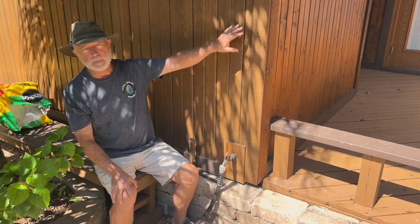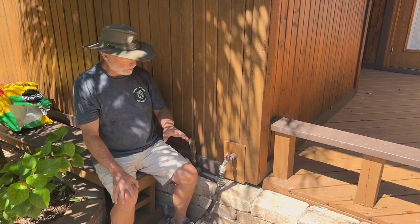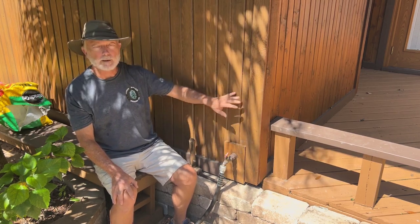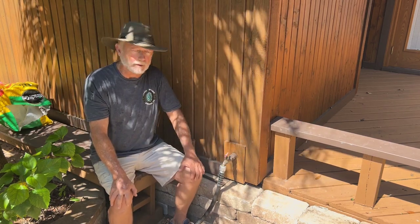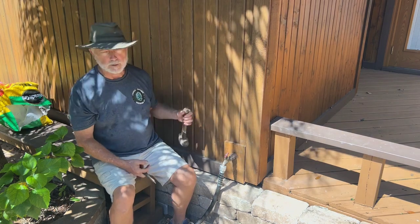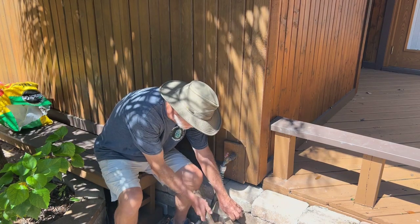I did a little detective work. We first thought maybe there was damage on the back side with water running through there, but that ended up not being the case. Then I thought maybe the break was behind this wall down underneath the crawl space — this is off-grade here — so I went through the crawl space and checked this corner. No pipe, no leak, no water anywhere. That left this area right here, so there was nothing else to do but take all these pavers out, see what's underneath, and find the leak.